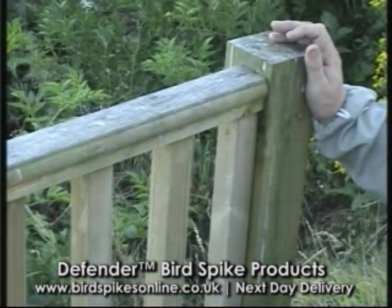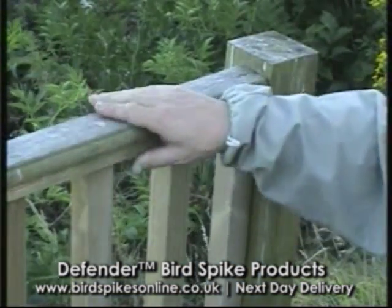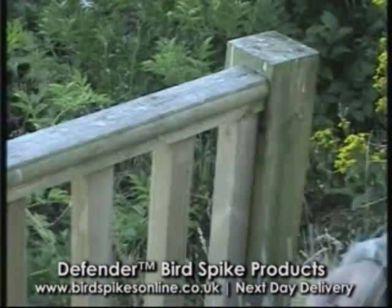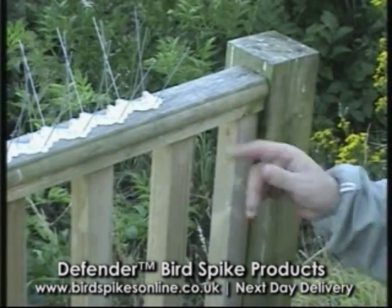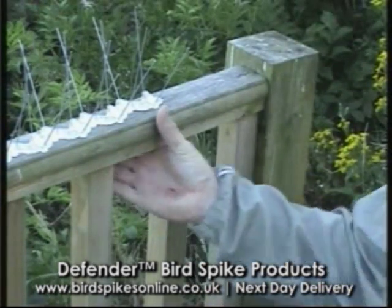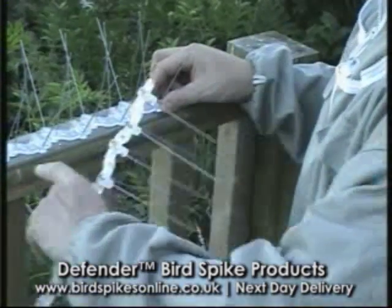Here we've got an unusual situation. Here you can see the pigeon droppings. The pigeons are landing on this handrail and staining it. But obviously it's going to be a little bit of an eyesore putting the spikes on there permanently. What I would recommend to the customer in this situation is that you use a cable tie to hold it in place, or you actually just pop a screw in either end through the little holes and screw it on.